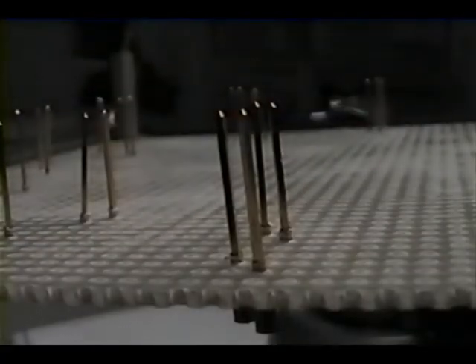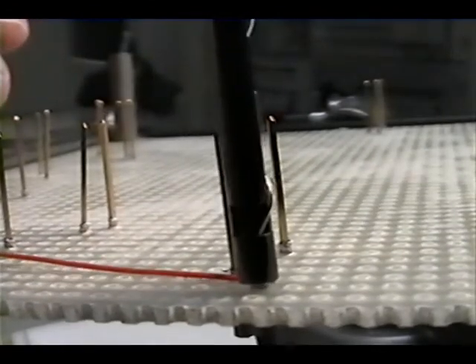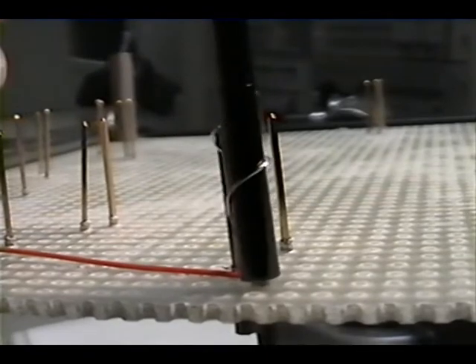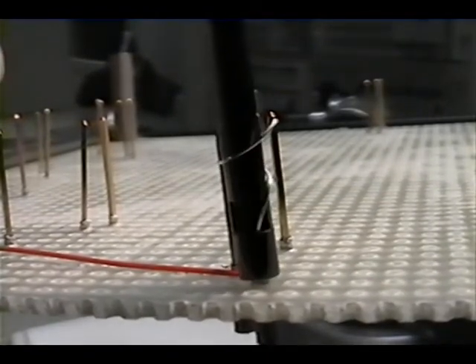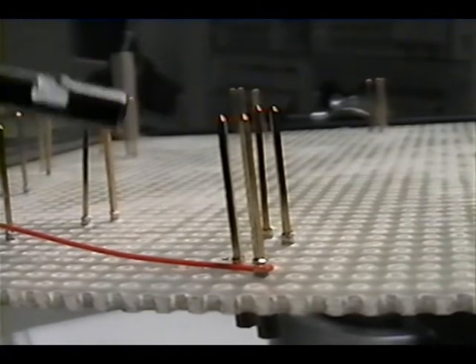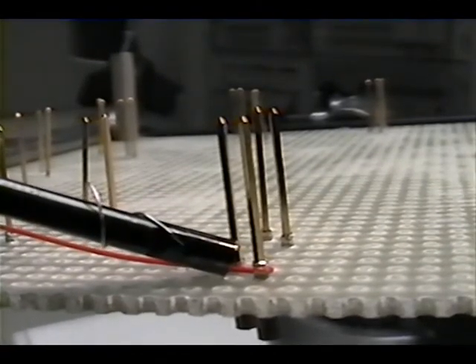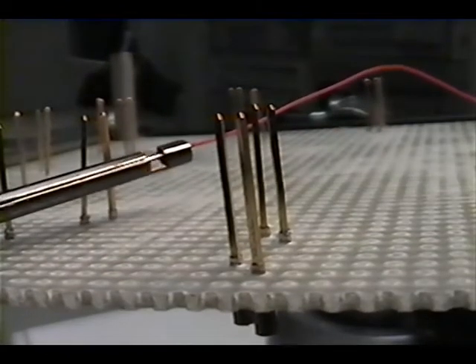Here is an example of the Radio Shack tool with wire inserted and being applied. Here's a bad example: the wire was not allowed to remain in the spline, and what happened is it wrapped around the tool and actually fractured the wire as it was wrapped around the post. Make sure that when you put the wire into the tool it stays in the spline and doesn't wrap around the tool as seen here. This wrap will have to be redone.